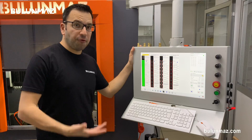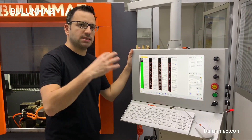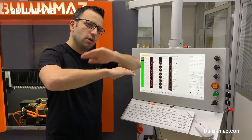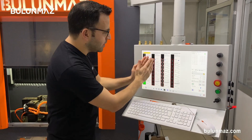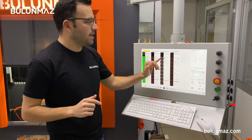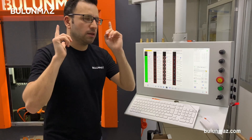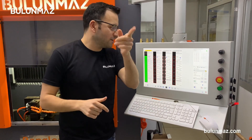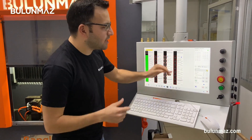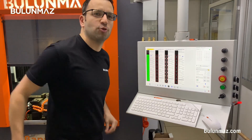I will use four different tools in this model. First, I will engrave the background of my bangle — that's the first process. You always have to engrave the background first. Then I will put points in a square shape. Then I will design around the square with the third tool, a 0.5 line tool. And finally, we will cut out the center of the bangle and our model will be ready. Let's start the operation.